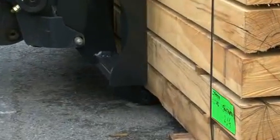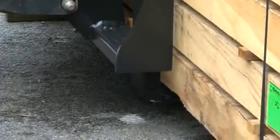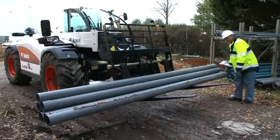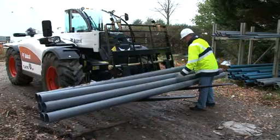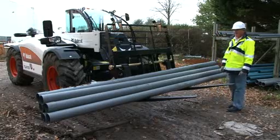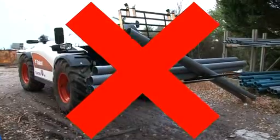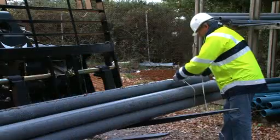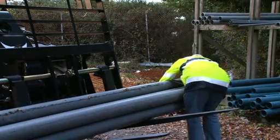When lifting loads, insert the forks all the way under the load to keep the load center close to the machine. Inspect the load for stability and check to see that the load is evenly distributed. Place heavier items on mixed loads nearer the fork carriage. Never lift an unbalanced load. It may be necessary to secure the load prior to lifting.